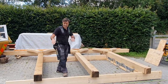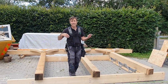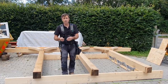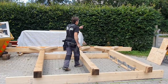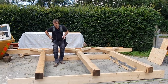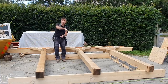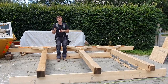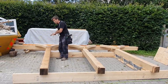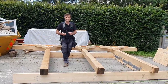I'm not going to take anything off the lengths — I always like to leave as much on as possible, in case we make an error, have to adjust the tenon, or we cut into it and find something we don't like. So I'm going to cut the very ends dead square. To do that I'm going to make a simple shoulder box — I just slide it straight down, put a clamp on it, and run my circular saw straight the way round. It's perfectly square and true, without having to put pencil marks around it. I'll also slide it further down and use that to form the shoulders of the tenon as well.